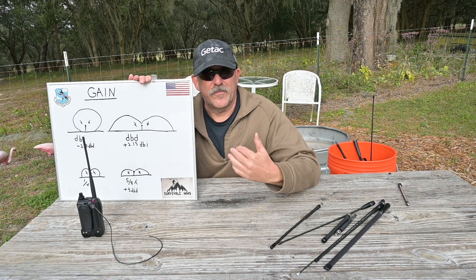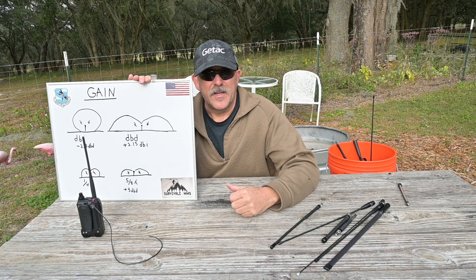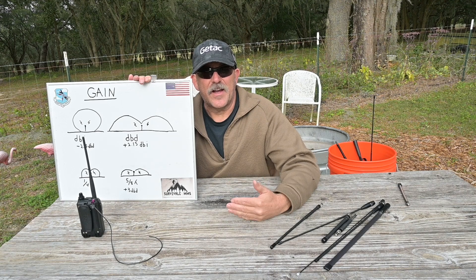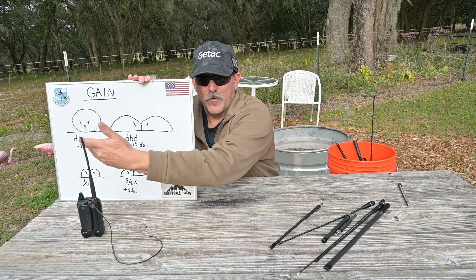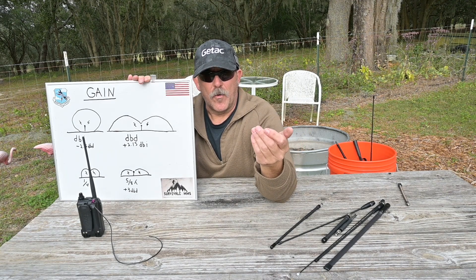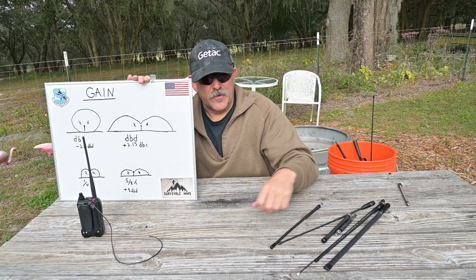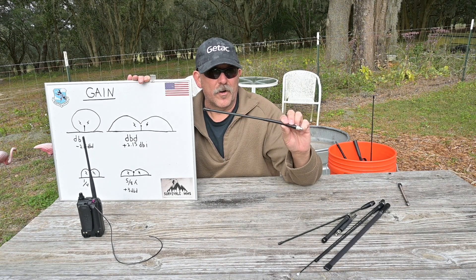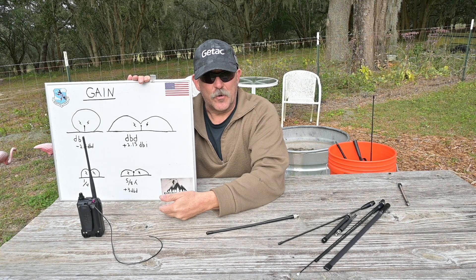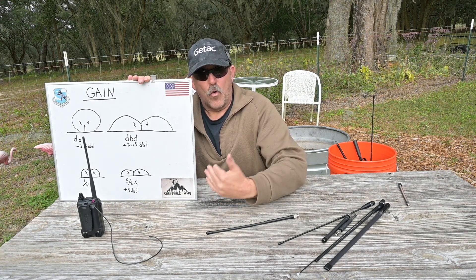The measurement of performance increase in antenna systems is expressed as gain. Gain is radiation-focused, nothing more. Like a binocular magnifies what you're looking at, it also costs you by reducing your field of view. Gain is so often an overused marketing term because you need to have an exact comparison — typically expressed in dB over an isotropic radiator (dBi) or decibels over a dipole (dBd). You need to know where you are to know where you're going, meaning you need a reference. When someone tells you an antenna gives 6 dB gain, you need to ask: 6 dB over what exactly? Maximum gain is not desirable in all terrain. For example, a 5/8-wave focuses most of its energy towards the horizon and less up-tilt. Is this good in mountains? Perhaps not. Is it good in urban terrain? Perhaps not. Again, you need to know where you are to know where you're going.